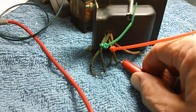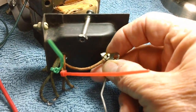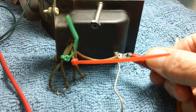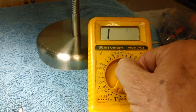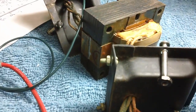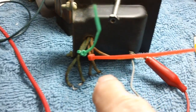The last thing to connect is the ground, which is this baby right here. It's even got a ground connector on it. Makes it easier to find, okay? Let's go ahead and connect it up. Again, nothing. Actually, this is good news. None of the windings are ohming out between each other, and I show continuity between every single winding by measuring across the two leads of each color.